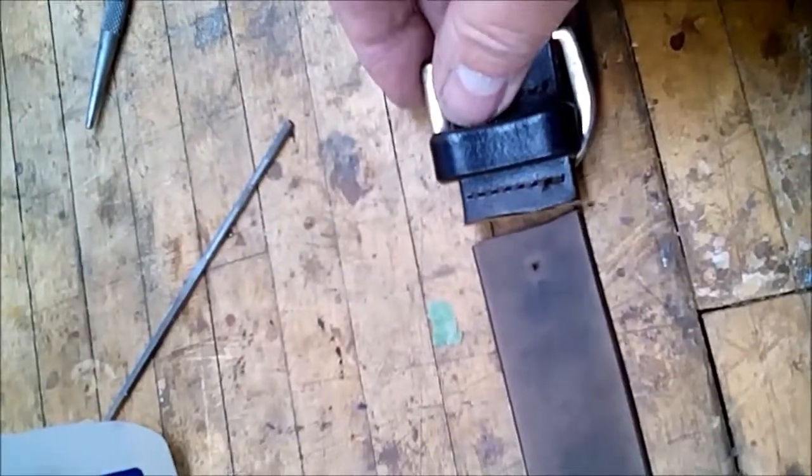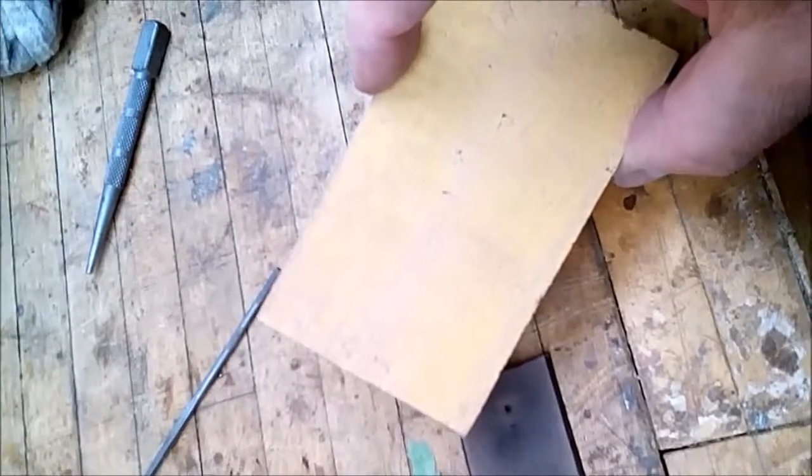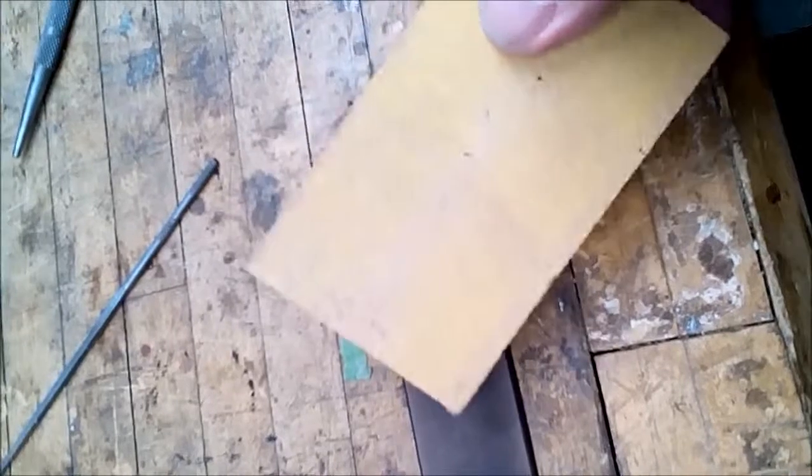What I've done is I've proceeded to cut off the buckle end of the belt. And I'm going to use a method to fatigue the belt to turn it into a little older looking belt. I started on this end a little bit — rubbing alcohol on a rag to get the belt soaked a little bit, and then my handy dandy 3M sanding sponge. This is a 180 grit because I'm not very patient, so I like to get it done. I'm going to work on that for a couple minutes and we'll cue back in.